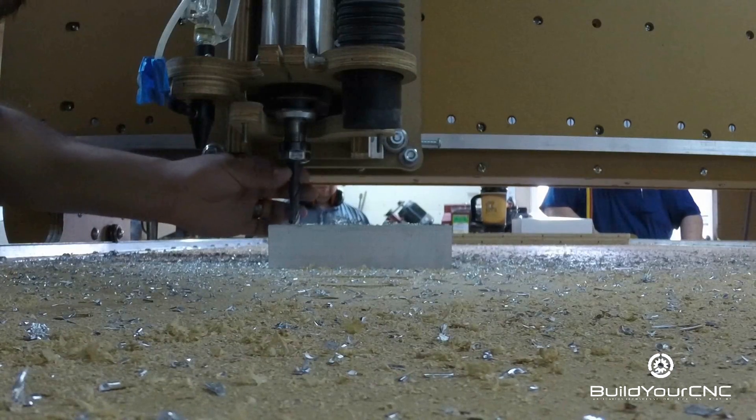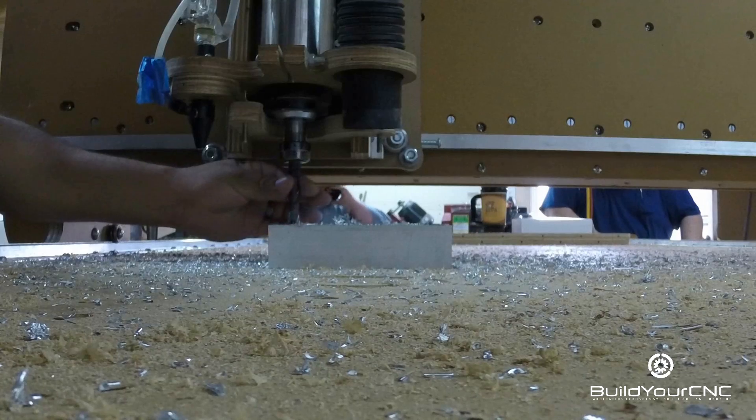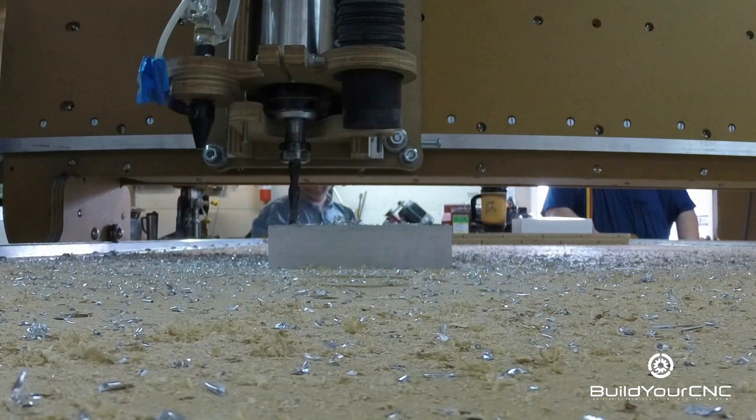We do add liquid later on, so the heat problem seems to go away. It could be that the end mill is simply the wrong material — not designed for cutting aluminum. I think it's better to go fast and stay fast, but just go light. The end mill is hot though — I touched it, which I wouldn't recommend. I was careful and comfortable briefly touching the end mill to gauge heat so you don't get burned if it is indeed too hot.